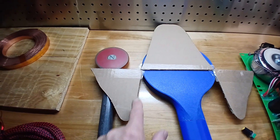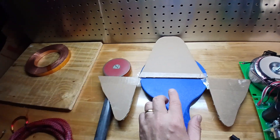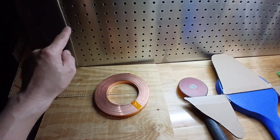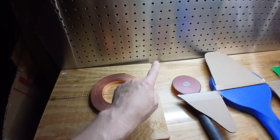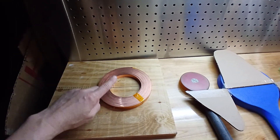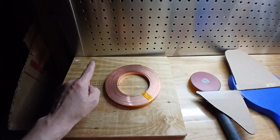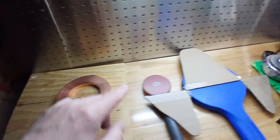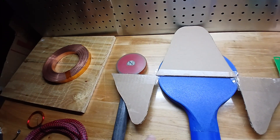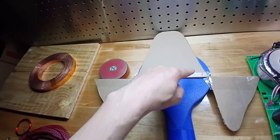It goes into the negative, then intensifies, and then drops back down to zero. These coils in the middle output the most intense field, and then the field goes around the coil in all directions. As it goes into this side, it will be pointing north, and as it turns around and goes back it will be reversed. That's why at this point it goes outside and then goes back around into the coil, and on the back of the coil it will have the same shape magnetic field.